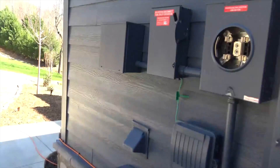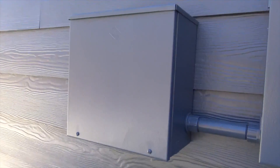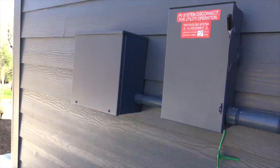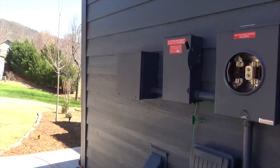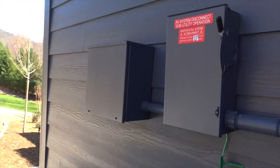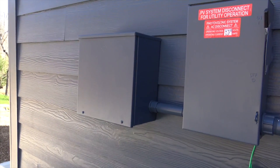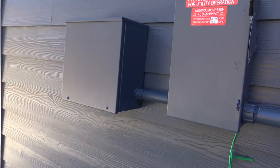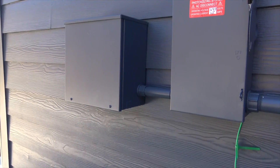One of the things we had to put in — you can look up PSP — we've got two relays in there that pick up 120 volts from the generator. As soon as the generator begins to crank, it sends a signal to the relay, turning the grid-tie inverter off and disconnecting it, which puts it into its five-minute cycle looking for the grid. That keeps the generator safe.